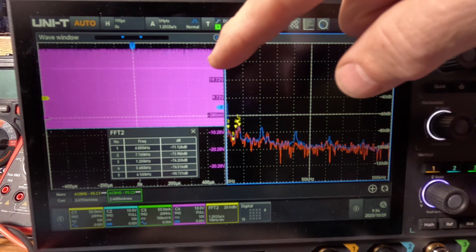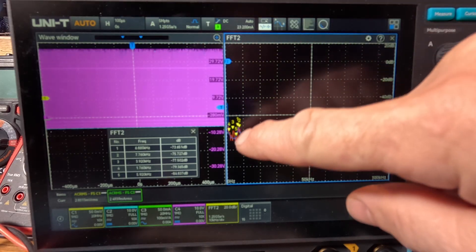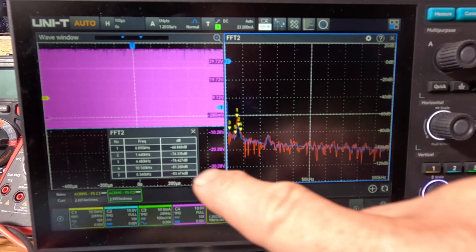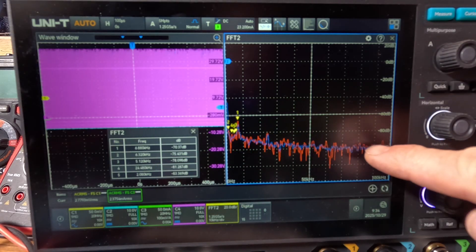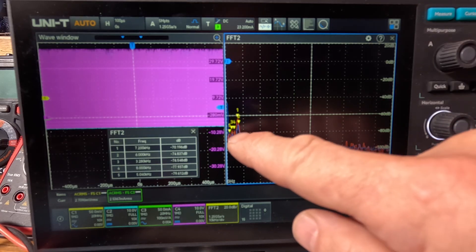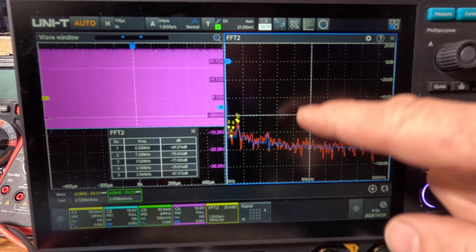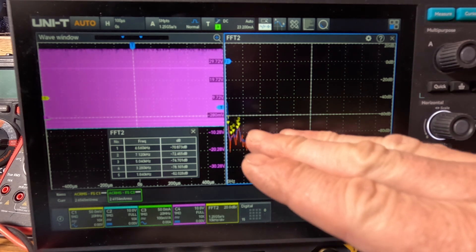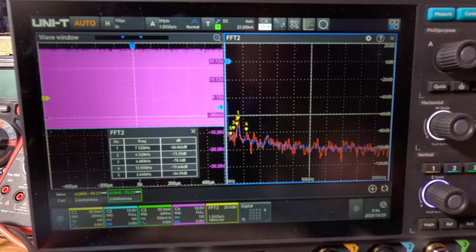At five amps load, the ripple cleans up — no more burst — and all the noise drops to lower frequencies, around minus 66 to minus 67 dB. It's 100 dB clean all the way out, then rises to about minus 80 dB with a few spikes. Burst mode had both narrow-band spike energy and a wideband noise floor increase — so burst mode is not EMI friendly.